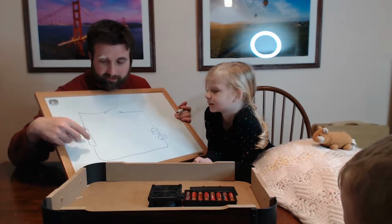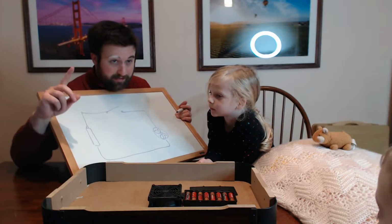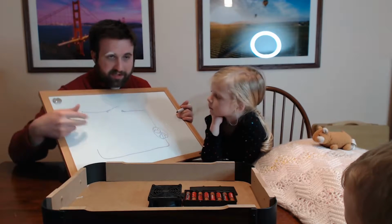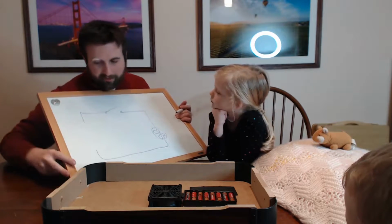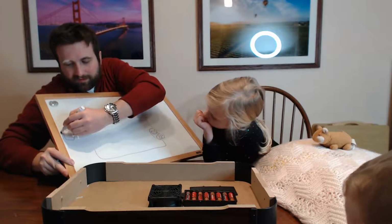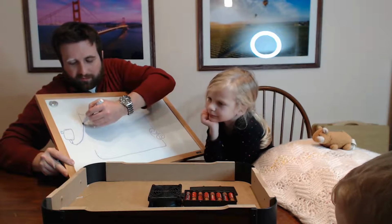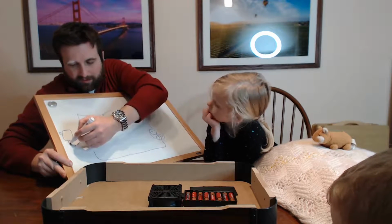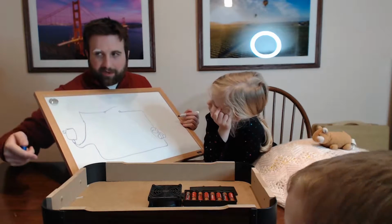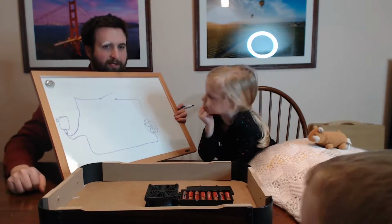So here's the trick. We have the battery powering the fan. But let's say we remove the battery. Now if we take it out completely, there's no power. However, let's say we have a wall adapter, and that wall adapter has 2 wires. One we connect here, connect it there. And by taking the battery out, the wall adapter will provide the power and the fan can still run.